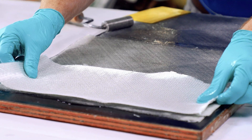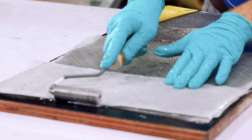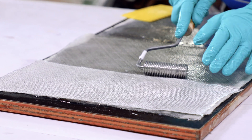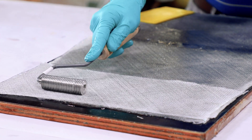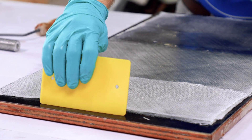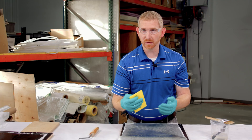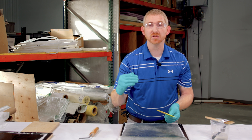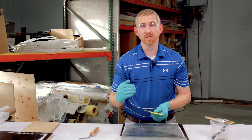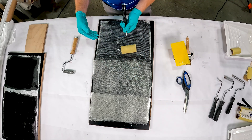Now that it's thoroughly wet out — still quite shiny — I'll come back with my brush and take some of the epoxy from the top edge and put it at the bottom for the third layer so it fully wets that out. There's no reason to put epoxy on too heavy at the start; you want to gradually build it up. Take the next layer of dry glass and lay it onto the surface, come back with the roller — you can apply decent downward pressure to compact those layers together. Once it's wet out and you have some squeeze-out of epoxy, come back with the spreader and pick up that excess, running it over the top. Wait a few hours until it gets sticky like masking tape, then come back with the 800 roller cover and roll epoxy on, gradually building it up to fill the weave of the cloth. Build it up until you have a nice smooth epoxy surface — a good base to sand and recoat, paint, or finish as desired.